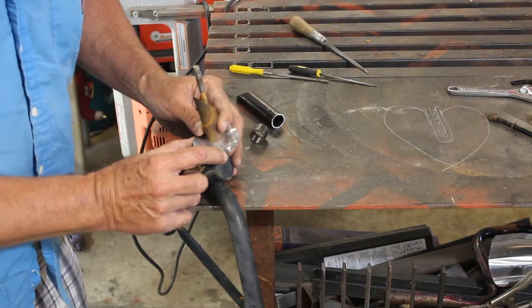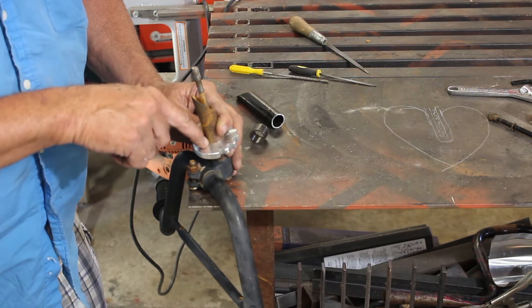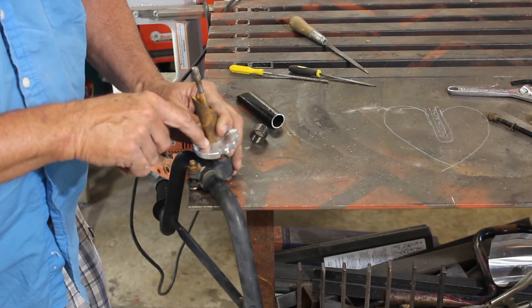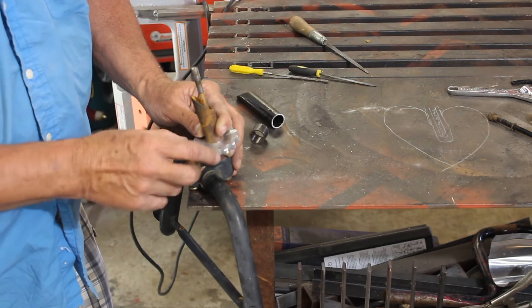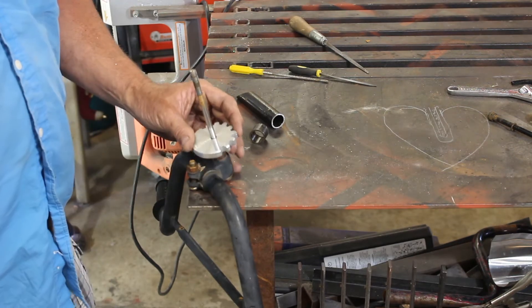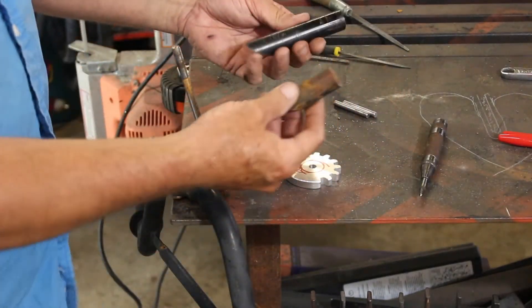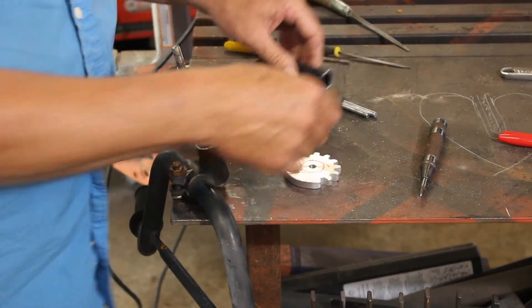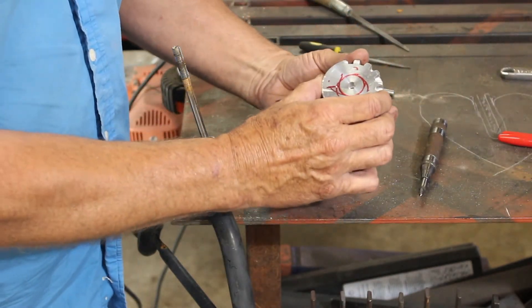What I'm going to do now is drill a hole in the edge and pass a rod through, then tack it on both sides of the gooseneck — that should locate the gear in place. Since both goosenecks are the same diameter, I'm just going to stack them and cut and drill them at the same time.